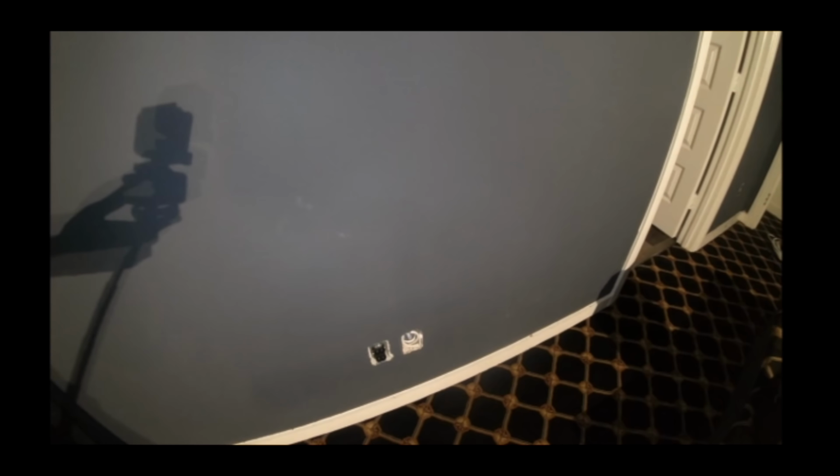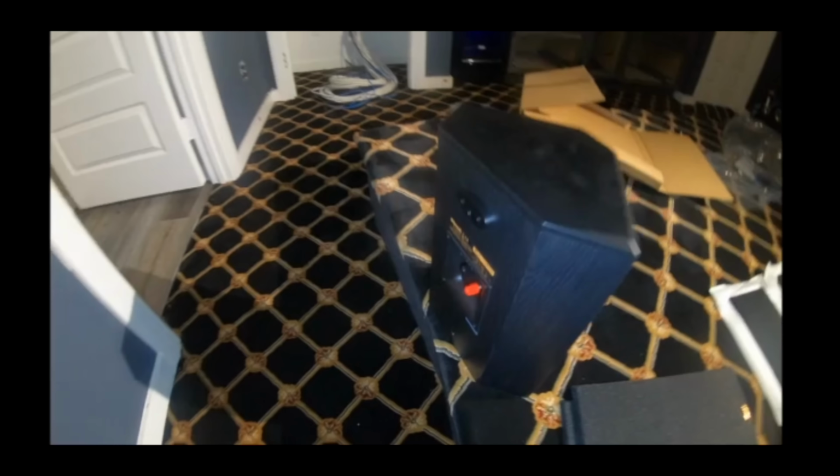And the way that they typically run these cables up the wall is they zigzag in the stud. So I'm going to mount this, go down about a couple inches or so, level with my pocket for my connections. I'm going to make an incision on the correct side of the stud, that being the right side of the stud, catch my wire, bring it through, snip it, trim it, put it in the speaker and mount it, and I should be good to go for our surrounds.